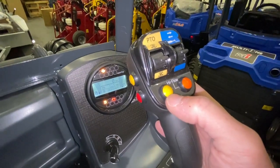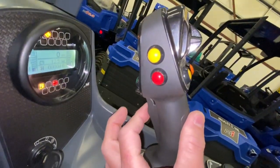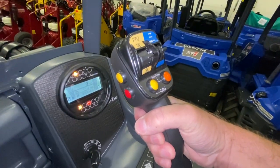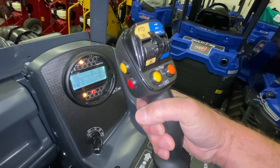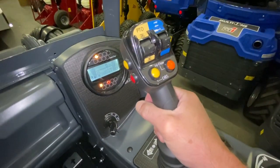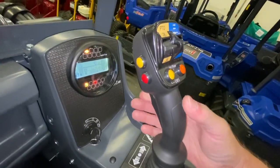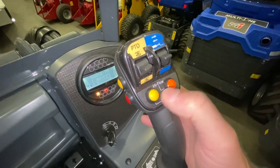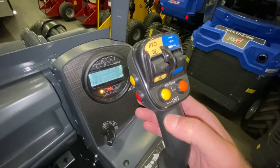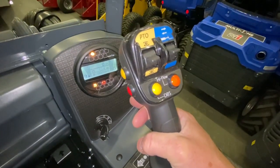But if you're in really sticky situations with wheels struggling in thick mud, you can use this trigger switch as well. There is no light for this switch. If you've got DBS on and you squeeze the trigger whilst still driving — whilst you've still got tractive effort on the wheels — this isn't so effective if you're stuck and stopped, but if you squeeze the trigger you'll equalise the oil flow to all four wheel motors and feel a pull of traction which should get you out of any sticky situation. That's called torque divider. That's DBS — dynamic block system. With DBS off, the torque divider still pulls in but only has a cross-axle effect — two opposite wheels lock out rather than all four. With DBS on and torque divider pulled in, you get equalisation to all four wheel motors and maximum traction.